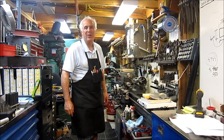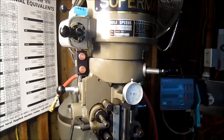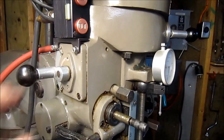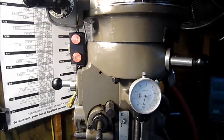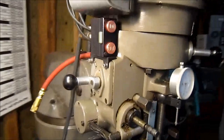That's the communication for the day. Hope you enjoyed. I was closing up and shutting off my lights and I looked at the two attachment screws for the speed control and noticed it looks like it's the same on-center as that bracket. Sure enough it is - bolts right onto the side of that cover. I think somebody designed it to do that. So there's where the air switch is going to go and I don't have to drill any holes. It's at a nice height too. It's not quite done done - I just need to finish up my air. I bought a regulator and some hose to finish that up.